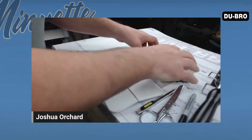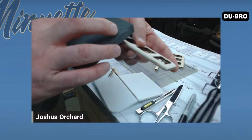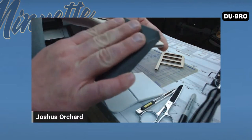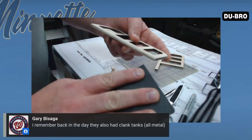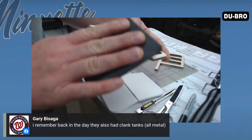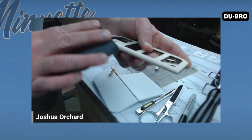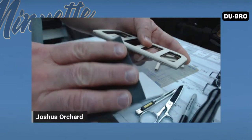And that's just simply done by taking your sandpaper or your sand pad here and running it along. And I don't go straight across. I go down and across, almost at a diagonal. And the reason I do this, I do it one at a time. I don't just go like this, is because if you get into one spot, it's more difficult to blend.